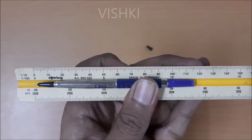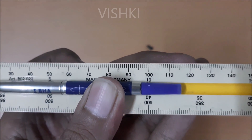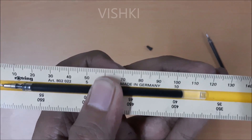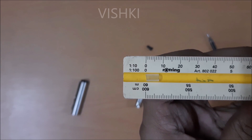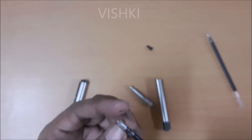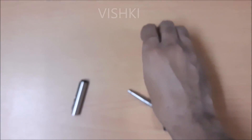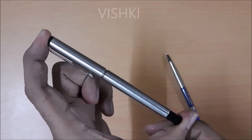This is the length of the original Parker refill — it is around 116mm. The original Reynolds refill is around 127mm. The length I have cut is around 117mm, but I think 116mm will be perfect. Out of the 10mm I have cut off at the back, I am using around 7mm as a sleeve. I suggest you first try with 117mm and make it 116mm later if you don't like the length of the tip coming out from the section. 117mm is the maximum limit — if the length is any longer, the cap doesn't snap like it should.